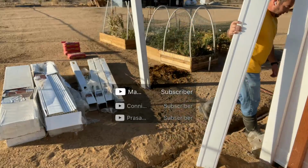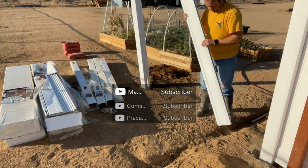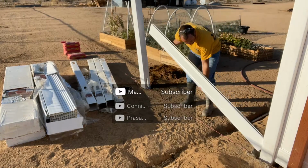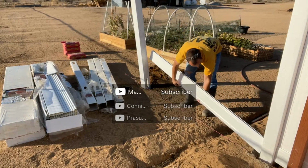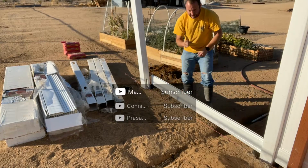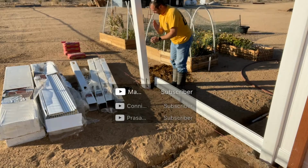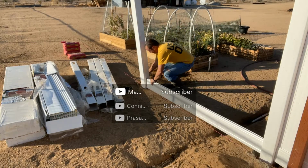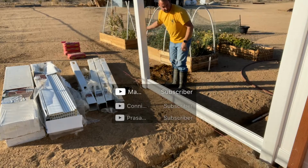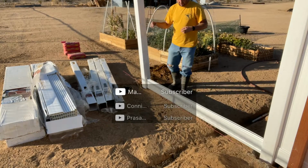So just, like I said, I've put in about 20 or 30 of these on our property, so I've had some experience with it. I'm going to slide it into the one that's already concreted in, that's already part of your fence. There are little flaps that you have to push in, so make sure to do that. Then you come over to your new one, tilt it outwards, and get the edge in, those little flaps in. And then you can pull it tight in between. So, if that makes any sense.